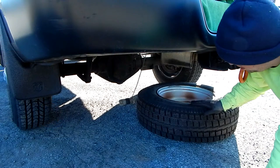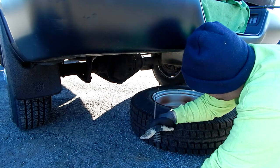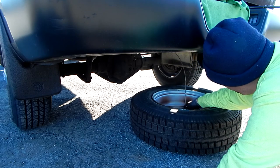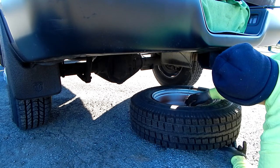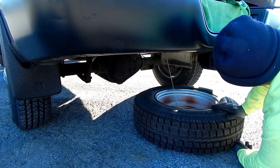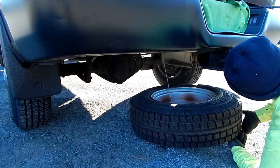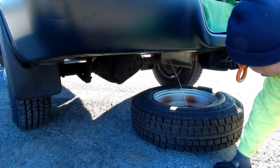There's a decent incline and all this gravel creates a bit of a ball-bearing effect, so I advise pushing the cable forward. The masking tape is on there — you do it like any other, it's a bit lighter and easier to lift than the 18-inch, that's for sure. I start cranking it up. Remember it's always better to have a little extra slack, especially if you're filming. As any elevator man who does rope jobs on a regular basis knows: better a mile too long than an inch too short.